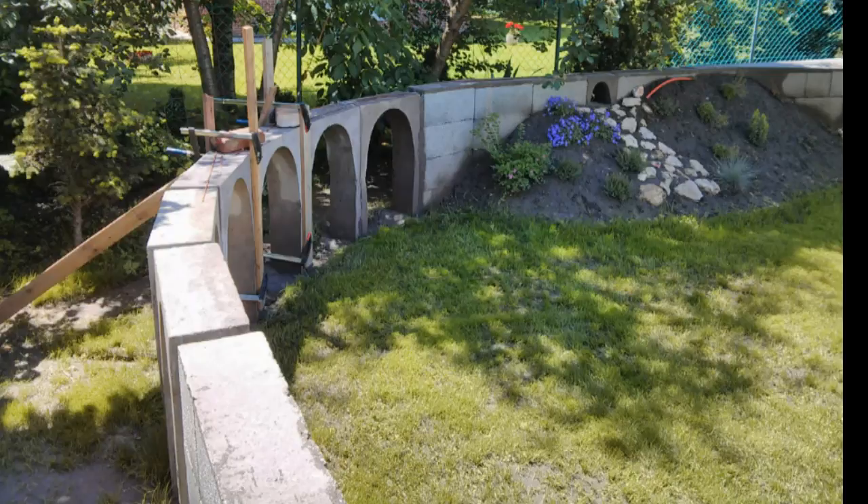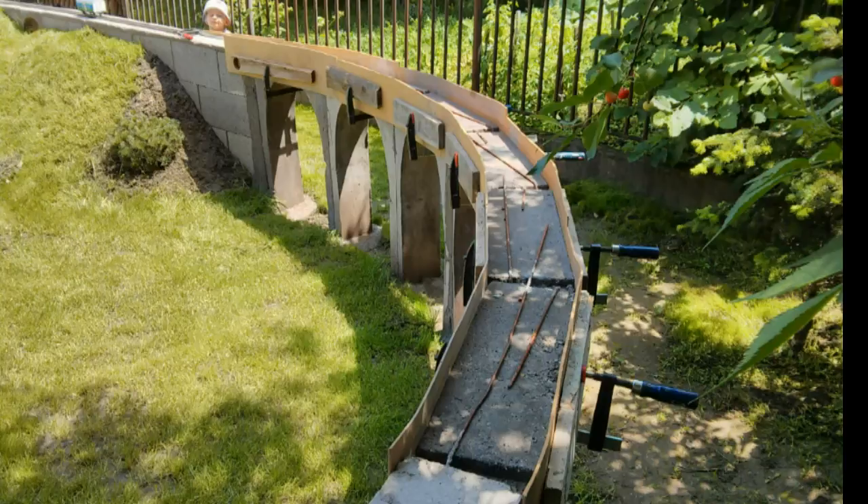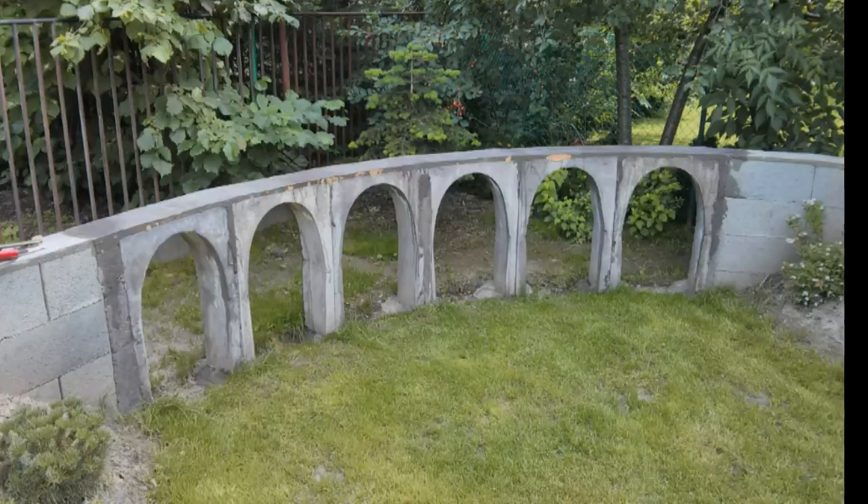Five of the arches were placed on a concrete base which isn't visible in the photos. The alignment was not perfect and I was afraid it would fall over, but the sheer weight kept them in place. With all six in, I put a piece of wood on each side to close the gaps between the arches and secured them with clamps. The diagonal wood on the side kept each arch perfectly vertical. I only had four clamps, so I did two gaps per day — it took about a week to complete. I filled the gaps with concrete and added more concrete at the feet.